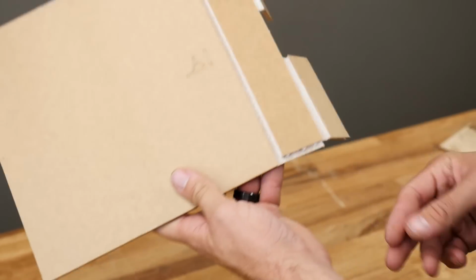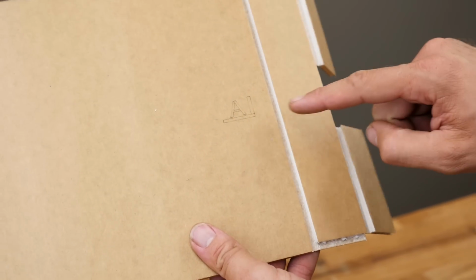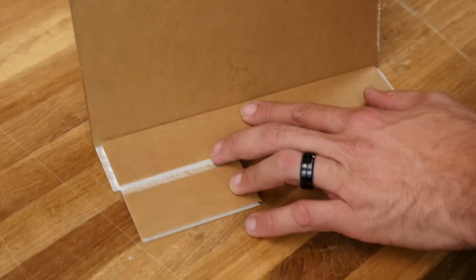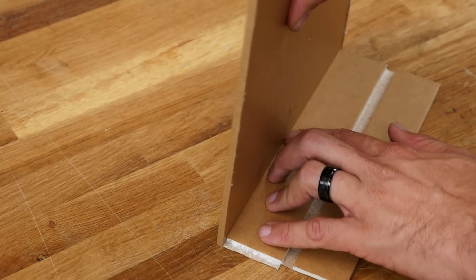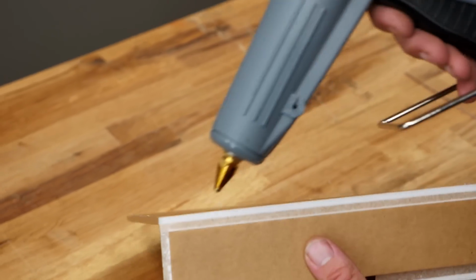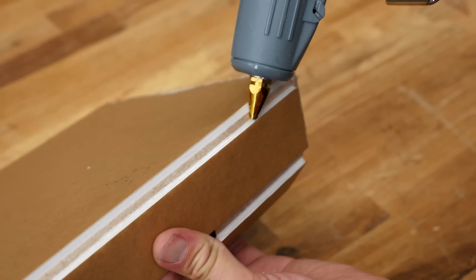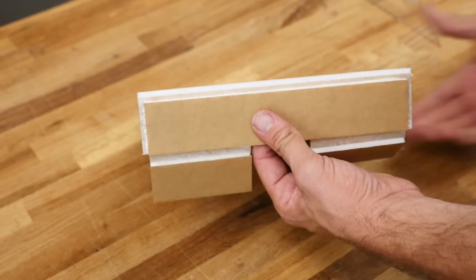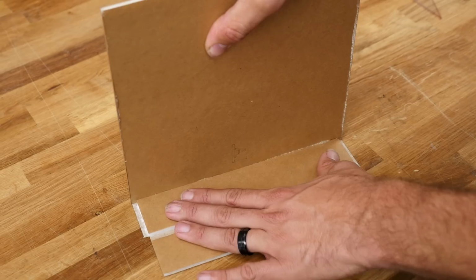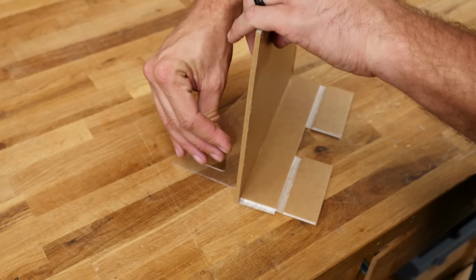Now I just put in the diagram, we only have one side of the A-fold, so we're just going to make it look just like that. Here's our side plate, here's our bottom plate. So just do a practice fold real quick, make sure we got it down where we need it, and we're always going to focus the majority of our glue on the part that brings us the structure. So that's going to be right here on this foam, about 1/4 inch from each end. Side plate going against the table, bottom plate rotating up to 90 degrees. And then in this one especially, hold the 90.